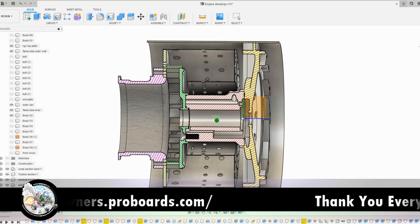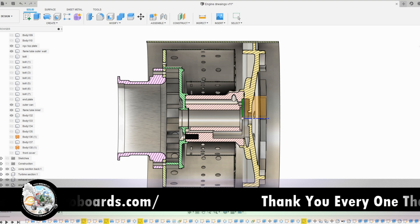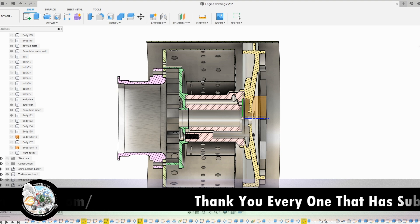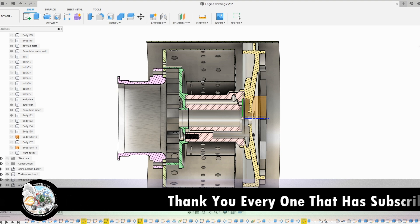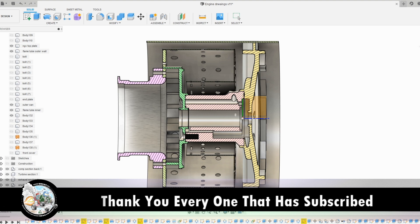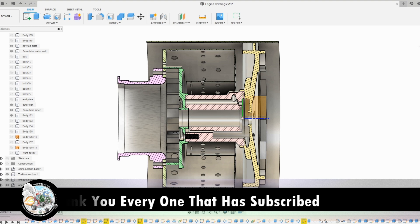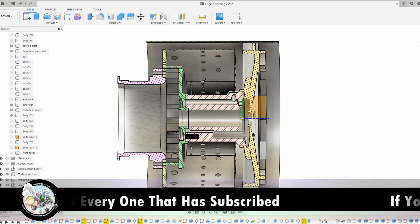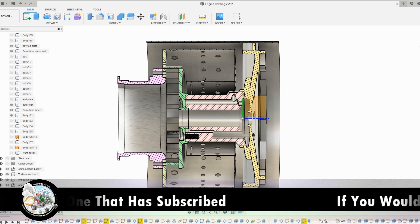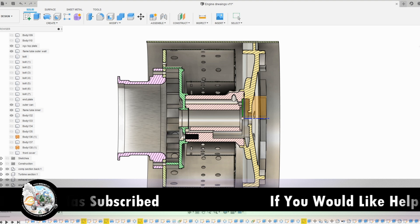The vanes on the front plate you can see here — I've had to draw these from scratch and then work with Terry. We've got the main oil gallery here; oil comes in at the back of the front diffuser plate, it's cross-drilled, and there are two cross-drillings which then go into the brass bushes. That's all the bearing assembly that fits in here, and then the return drains out down through the engine.